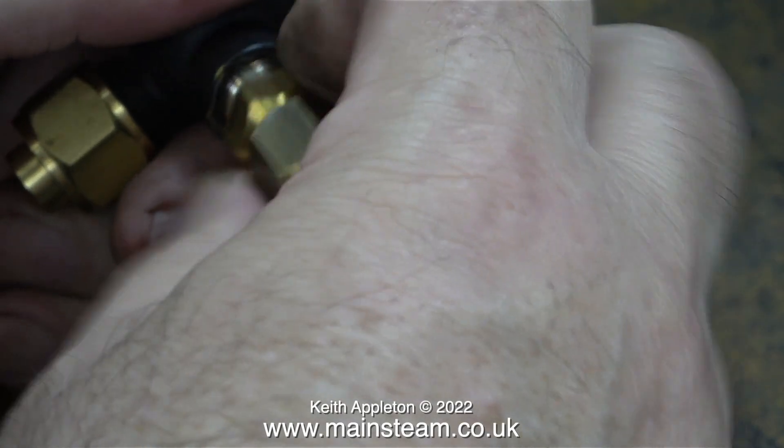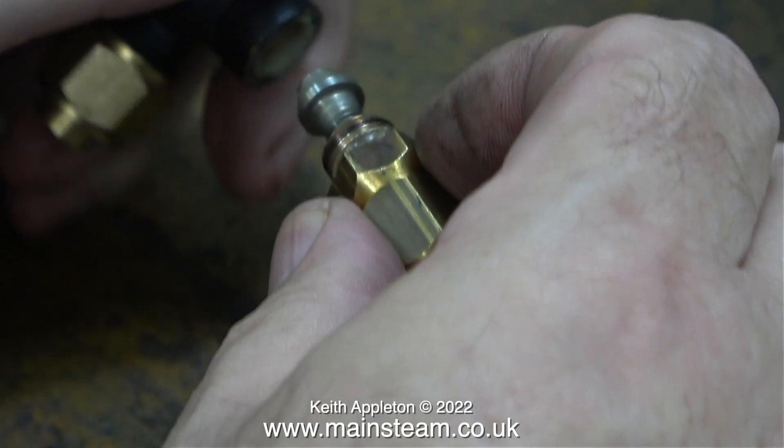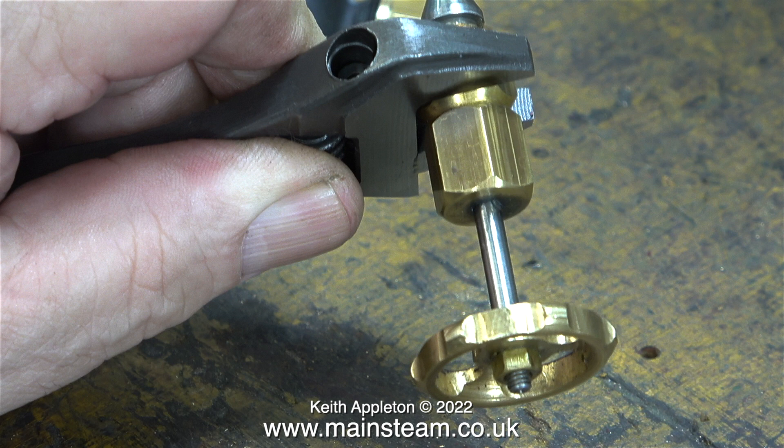I need a quarter-inch diameter pipe feed to the steam pump that I'm fitting to the traction engine. It's a simple enough job to make an adapter-type tee piece, and I've shown this in many videos on my channel. Repurposing the body of this steam tap seemed like a good idea as it didn't work anyway, and it's going to take a lot less time to make.